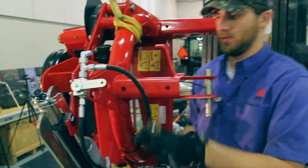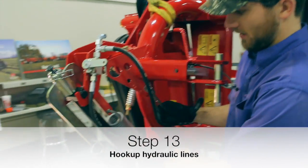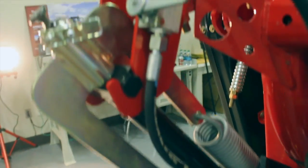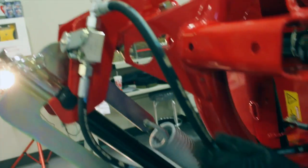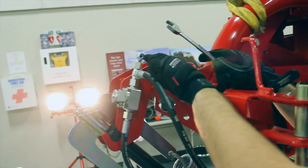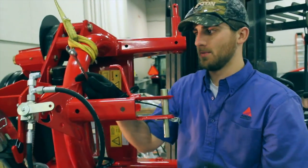At this point it's safe to hook up the hydraulic lines. The hydraulic line that comes off the helper spring cylinder has already been installed. This line comes back to the main lift cylinder, and then the line that comes loose in the kit bolts up here and is the one that hooks to the remote of the tractor — your lift line straight to the remote.